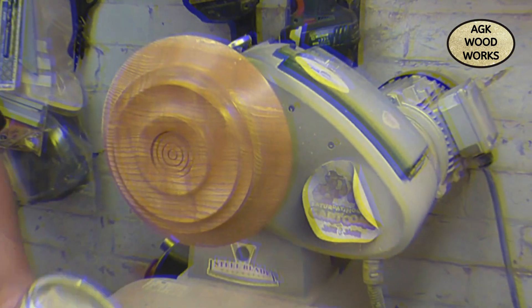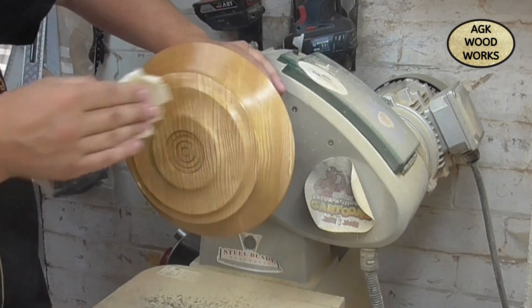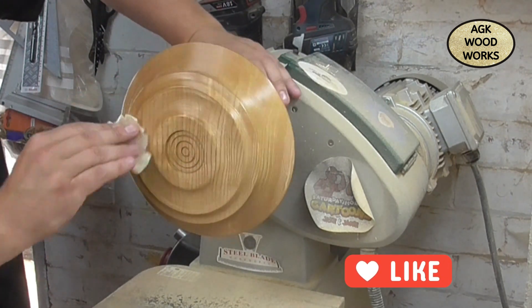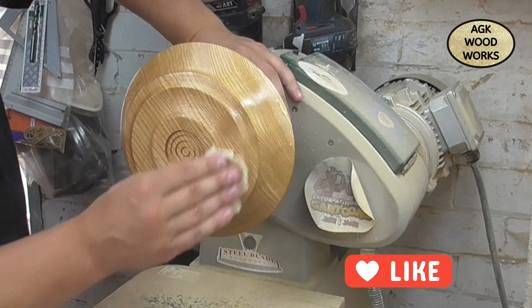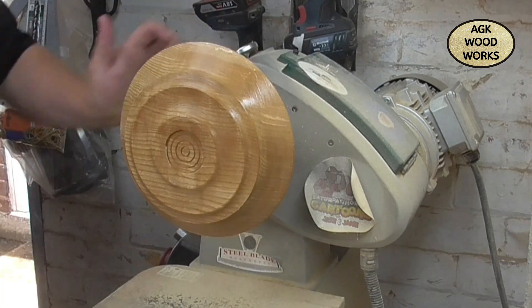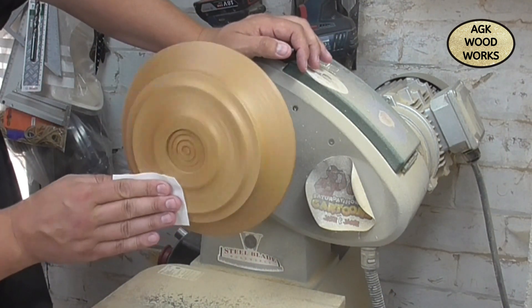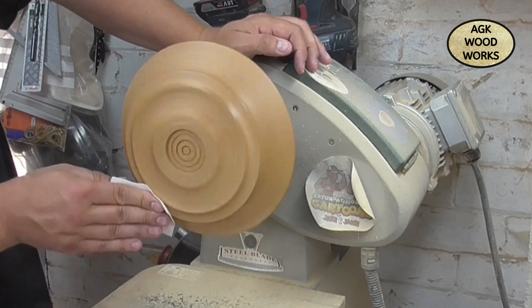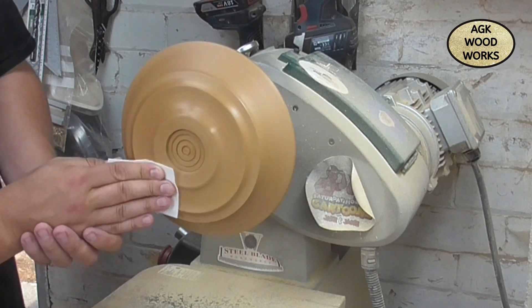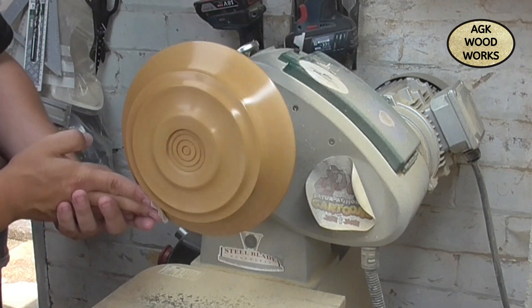I did that for about three minutes before taking it all off, and now we're onto the microcrystalline wax. I did put some Wood Wax 22 on before this coat of microcrystalline — I think I edited that out by mistake. Just now buffing in that microcrystalline wax — it comes to a really nice shine and gives a long, hard-wearing, fingerprint-resistant finish after it's all cured.